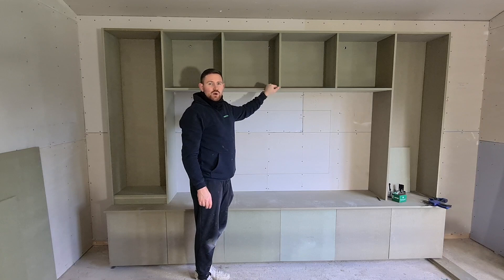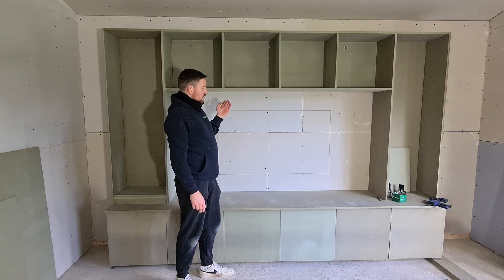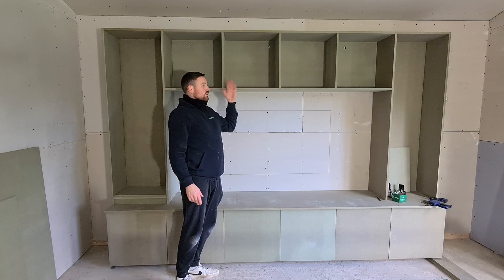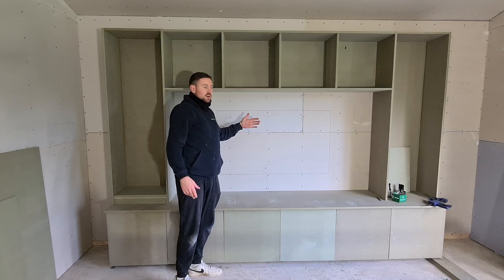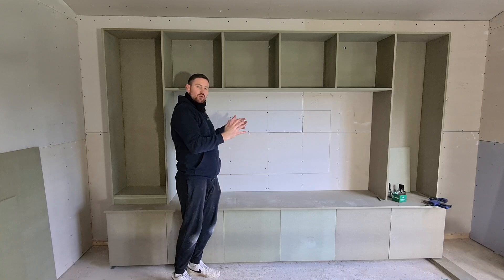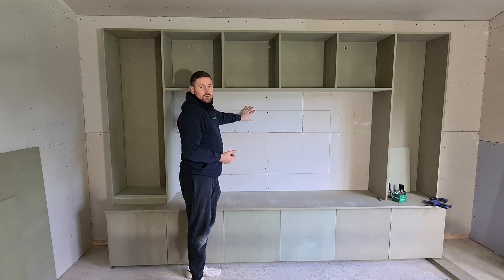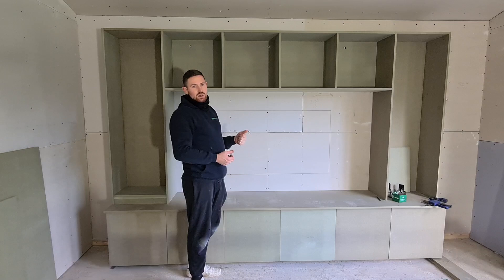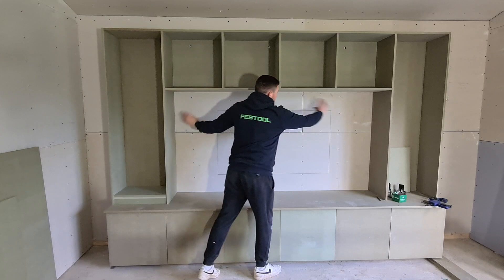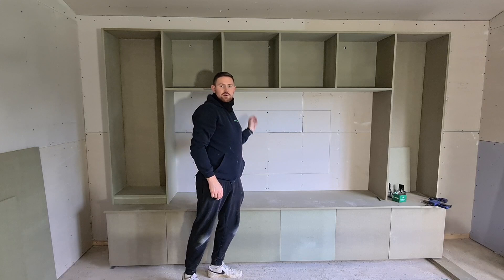So what we've got to do now is create a backboard for the TV. I always do this on my TV units. Number one, it makes the telly sit at yet another depth. So we've got the depth for the front units, the depth for the tower units and the top, and it's then good to bring your telly out to a different depth. You've got the wall deck round the perimeter, so you're dealing with four different depths — and it just makes it look so much nicer. That void behind also gives you space for all of your cables — HDMI's, ethernet, power cables — and gives clear access any direction from behind the telly, keeping everything completely hidden.